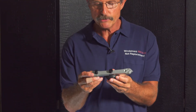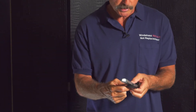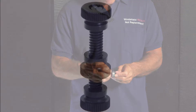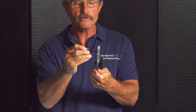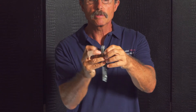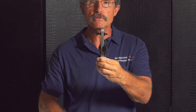The other tool the Wonder Bar makes is the Star Leg Flexor. Assemble it with a two-inch stiff suction cup — stiff because it gives more pressure, and you'll need that extra pressure to flex open the leg. The bolt for this is called the Star Flexor bolt, which has two nuts on it to hold it in the injector hole. Take the Star Flexor nut, place it in the hole with the grip part of the nut to the bottom, and that bolt is what you use to increase and decrease pressure for the Star Leg Flexor.